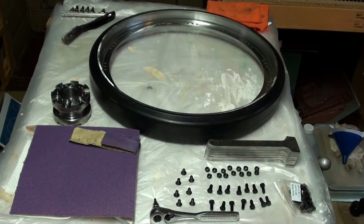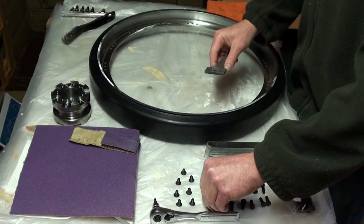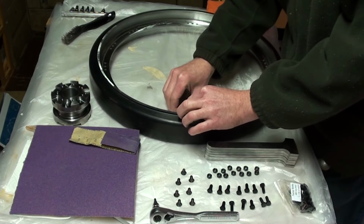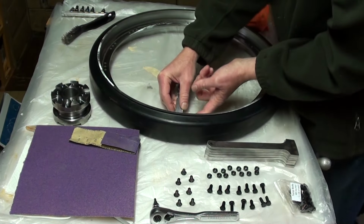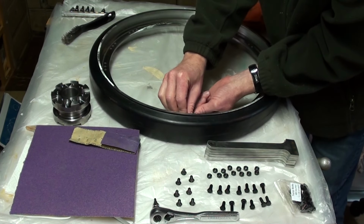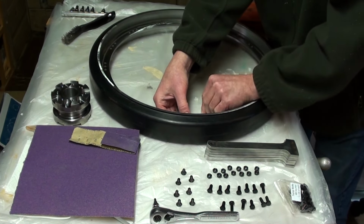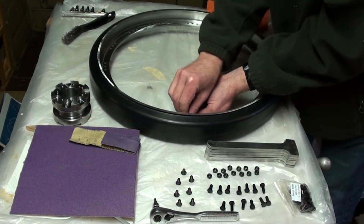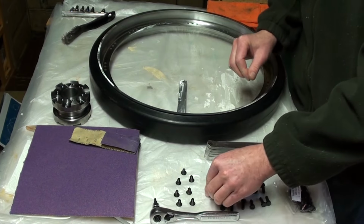Once all metal parts were prepared, it was time to begin assembly. All parts were clearly identified when initially packed. Take careful note and study each part to ensure they can be identified later. At times, it might be helpful to use a permanent marker to identify similar parts after cleaning. Parts were test fitted together before any final or permanent assemblies were done. It is much easier to make corrections when parts are loose or sub-assemblies are smaller. There's spoke B.